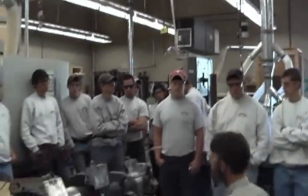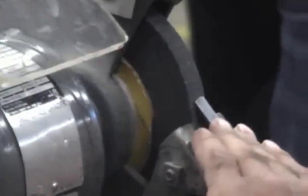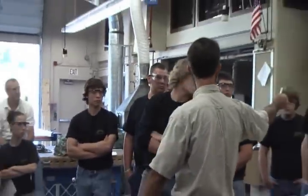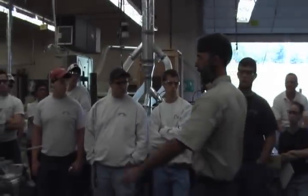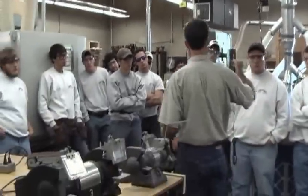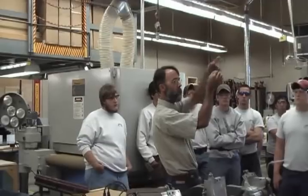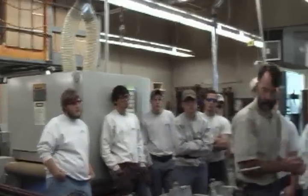Okay, let's see what we've got. It doesn't look bad. I've just done a scratching across my black, and it's given me what looks like a vertical white line, which is actually kind of nice, because that's telling me this tool rest is already set at the angle that I want it to be. When I go in there and grind, it's going to grind from top to bottom of that curve, which is great. Don't have to change it.